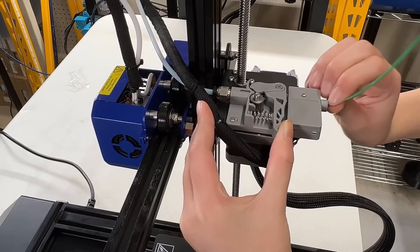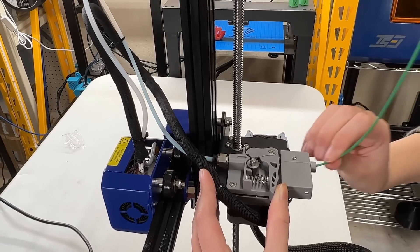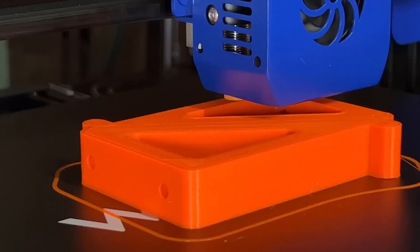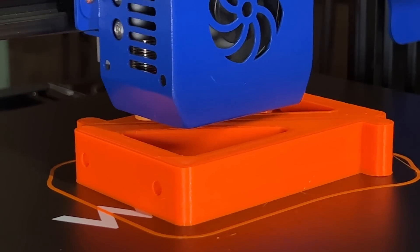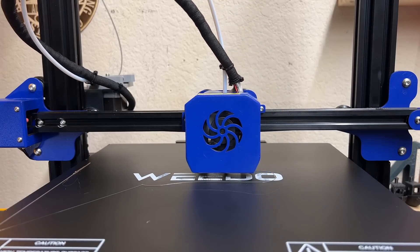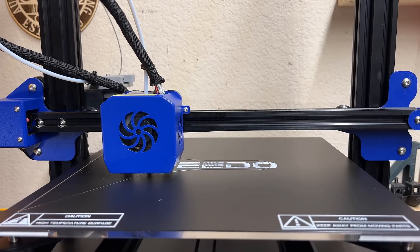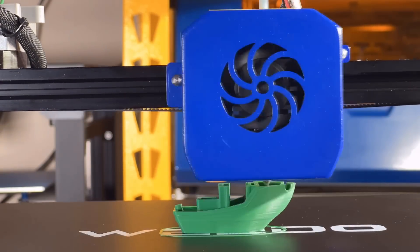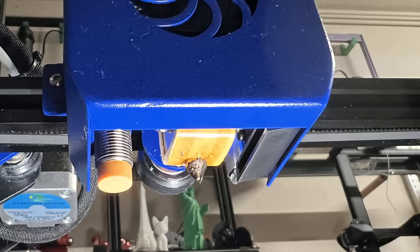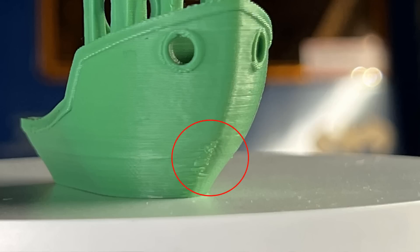It just came with a very basic single-gear plastic extruder. I would prefer a dual-gear metal extruder as it grips the filament better and is more durable in the long run. The Bowden tube setup is not always worse than a direct drive — when it comes to high-speed printing, the Bowden setup's lightweight print head has its advantages. However, this printer is not designed for high-speed printing, so it would be better to just have a direct drive extruder. The single 40mm 4010 blower fan for part cooling may not be enough — it's the same size as the one on the Ender 3. For now, the fan duct is too far away from the nozzle, so unless the fan duct is redesigned to get the optimal angle and distance like the Ender 3 S1, this fan may not be good enough for some overhanging parts.